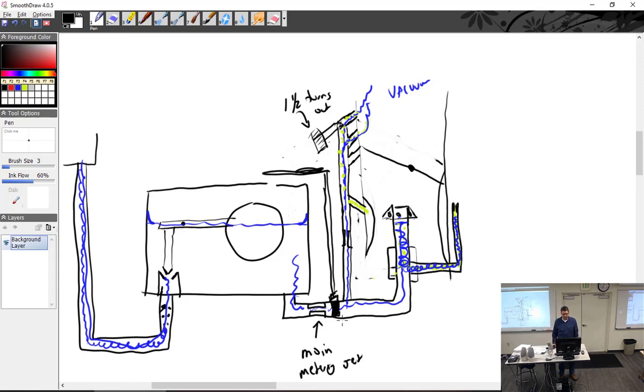And then it died. That's how Marvel Schebler runs all of their mixture controls that I can think of off the top of my head right now. It's just a valve down here that we close off. And when you push the mixture all the way in at full rich, it pretty much just takes the valve out of the way and fuel flows and the main metering jet does all the metering. So the valve is actually useful, and it's pretty good at shutting off fuel.